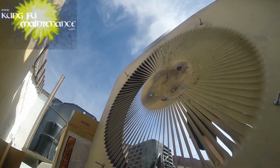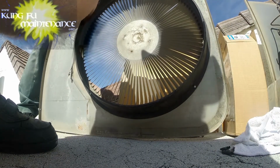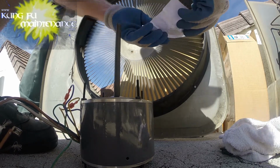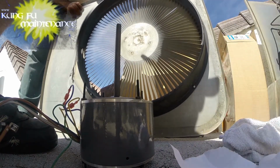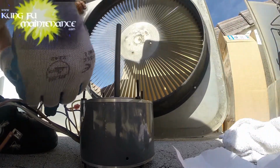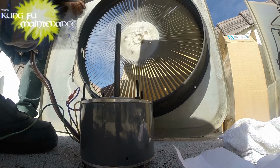So we're going to position our wires towards the conduit hole, which is towards the front. Probably makes sense to go over here. I wrapped my packet of bolts and screws in a piece of paper to make it a little easier and not get everything lost. This one, the lid's a little weak, so I'm going to be using these washers to really strengthen it up. The other thing is our ground wire. We'll need to either attach it, I like to attach it to the bottom of the bolt sometimes, or even go around the conduit and attach it. I'll probably do that.